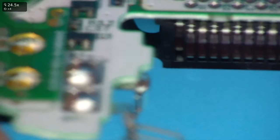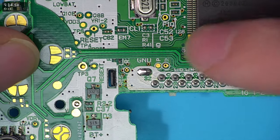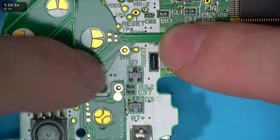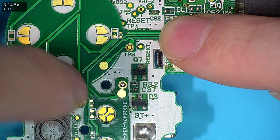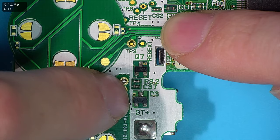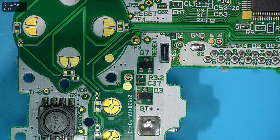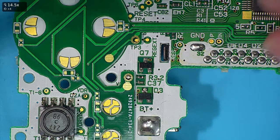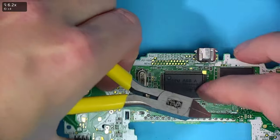I will move that row up slightly. It's going to be a flex board so it's not going to cause any issues, but it's obviously not accurate, so we'll fix that — that's one minor note. Another thing I've noticed: if you know the clean screen for the Game Gear, the flex ribbons started off as circles and then I changed them to half moons. The reason is it's actually really difficult to remove solder when it's completely covered in a ring versus a half moon, so for ease of removal we should make these half moons. I'm just going to snip these now considering this is the prototype.